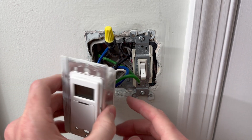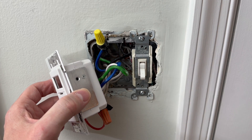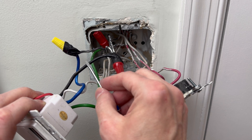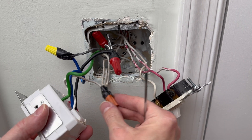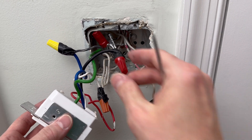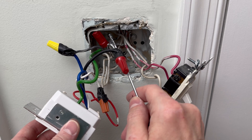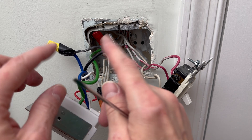In this particular box we've got limited space, so I had to tuck some wires behind the switch. I'm going to remove the other light switch to get access to the back. You can see the old switch has a red — for a three-way — but similarly has a black and a blue for the line and the load, as well as a green for ground and a white for neutral. Our interior light is a three-way, which is why you see the red. We're going to disconnect these and mark the two blacks as load and line respectively, so we remember which is which.